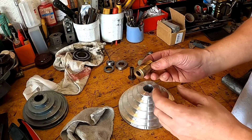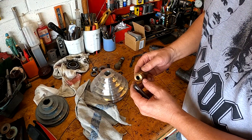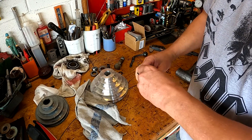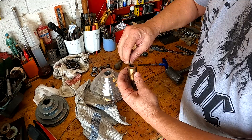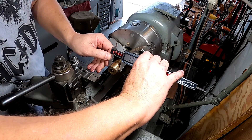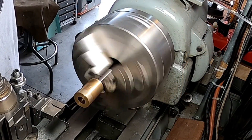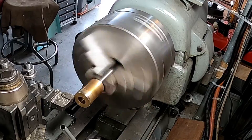I think I'll turn that down slightly — let's go over to the lathe. Actually, I don't really feel like making a bunch of changes over there, so I'm just going to put this on an expanding arbor and check that up. It's about seventy thousandths here.